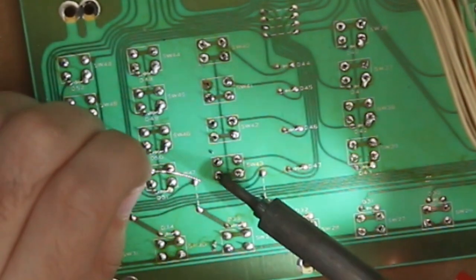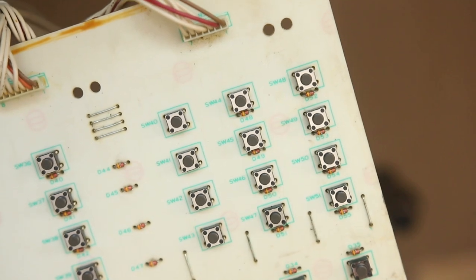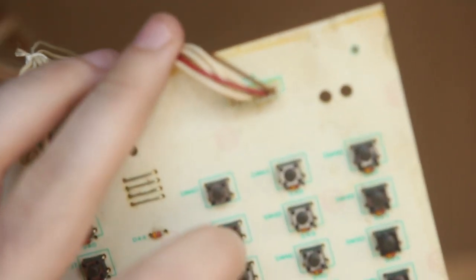While I was doing that, I just quickly opened up the keyboard. I didn't get any footage of it, but I pulled the key off, and it's like a pair of graphite connections that get made. And so I cleaned that up a little bit, added a little bit of pencil, and then reflowed the solder on all the connections around that one problem key, just in case they had a cold solder joint. Again, while it was open, I reflowed the solder around all the stereo jacks, because I thought there was a problem that might not have been a problem, or I might have solved it by reflowing the solder, but it doesn't hurt to do that. You don't really need to add more.